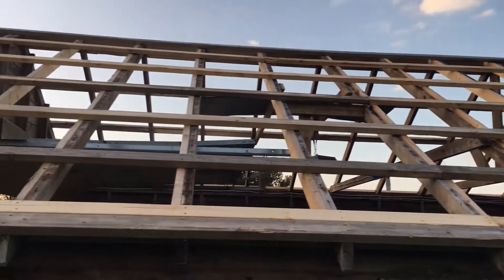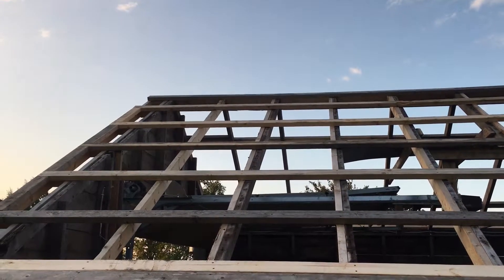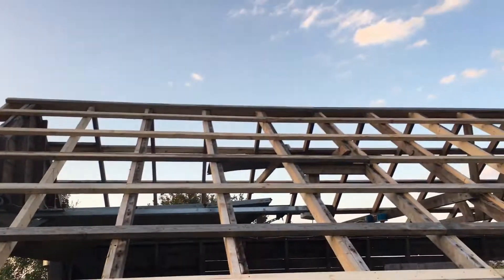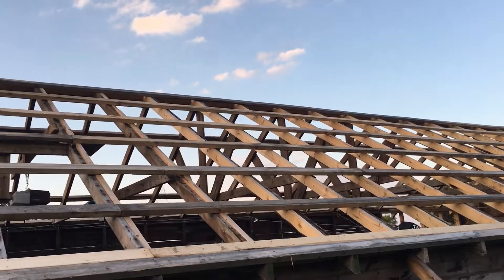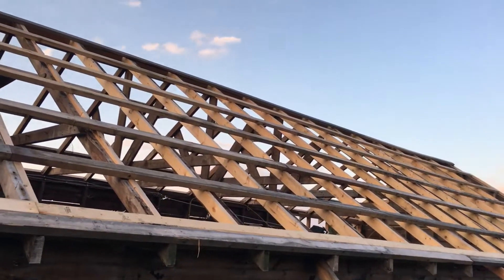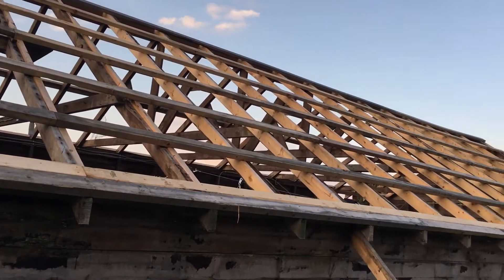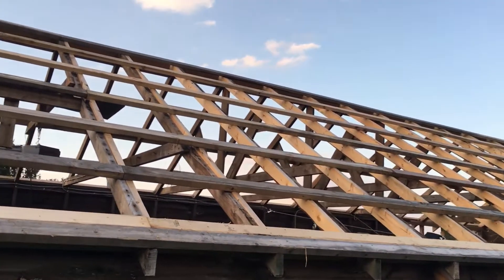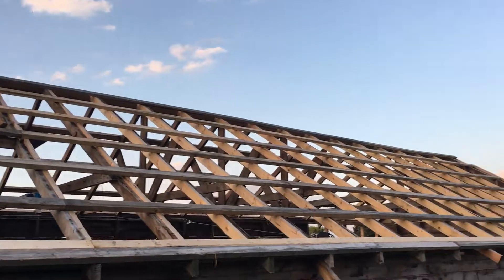Today I'm going to get the fasteners up and the three purlins done before I get to the top. I also have to put on — something I didn't mention on the other side — I had to put another row of purlin on the top because of the way the ridge cap spreads out. It covers quite an area, coming about nine inches down from center to the bottom of the ridge cap. There's a long area in there to screw it down, so I should be fine by adding another 2x4 below that top purlin.